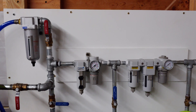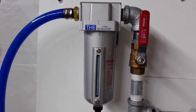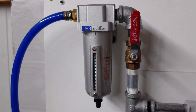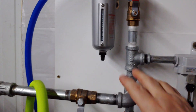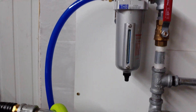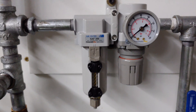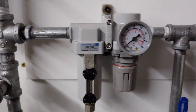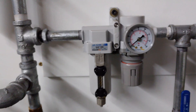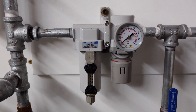My air conditioning setup: air comes in from the left into a standard filter with air-water separator — this is a 90 CFM unit — and I put all the air through this unit. I take my blasting cabinet air off of there, along with general-purpose shop air. The next unit is a finer filter, a 10-micron filter, with a regulator — this is a 72 CFM unit rated up to 150 PSI working pressure.